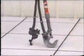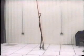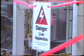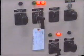When grounding equipment, remember to attach your grounding cable to the ground first, and then to the equipment. Generally, several grounds are attached — remember to work between these grounds. Barricades should be placed around the work area with warning notices to keep other personnel clear. All isolating points should be marked with the appropriate tags.